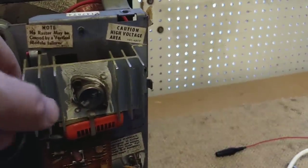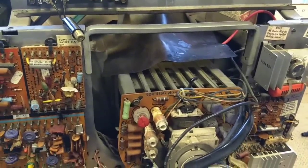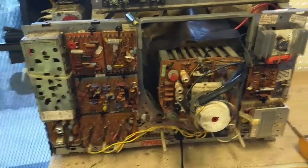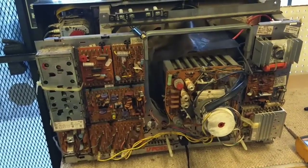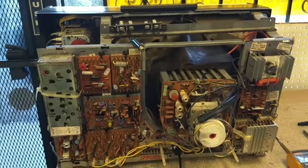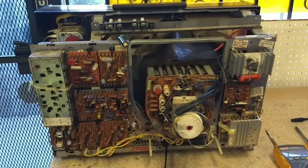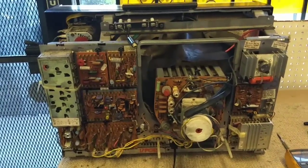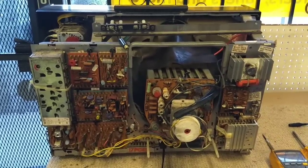Although, nominally, it's pretty cool. It's not hot or warm, even. It's barely just room temperature. And, so, I'm kind of burned out on this one. I still want to keep going and get it so that it works right. And, now, obviously, with the little degaussing thermistor gone, I need to get another thermistor in there. So, this set is really just kind of trying my patience. But, you know, it's one of these ones that I've wanted for a long time, and so I'm kind of torn between wanting to sell it or wanting to keep going with it. But that's where we're at right now, is that everything's cool except for the high-voltage regulation problem, and the B-boost is looking good. The rest of the voltages are looking good. I'm hoping it's not a bad tripler. I'm hoping it's something else, because I really don't want to buy another tripler. But, yeah, so that's where we're at. So, thanks for watching this series so far. If I decide to get into it more, you'll see another video. Otherwise, other stuff to come.